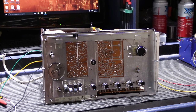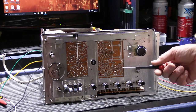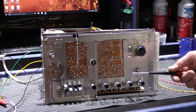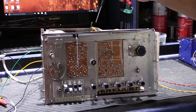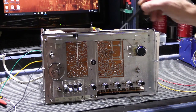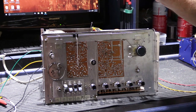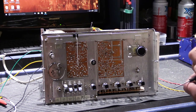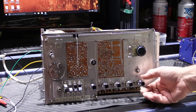Okay, I'm back. So just a little bit of time has passed. Fortunately, swapping out the tuner board is not very difficult. There are just four wires that connect it to the rest of the receiver, and the diciest part is you have to deal with the pulley and the dial cord that goes here and here and down here. So you have to be really, really careful not to let the cord fall off the pulley, because if you do, then it's a major effort to get it all lined back up. Anyway, it went well. It only took a few minutes to swap out the board.